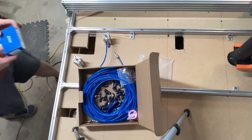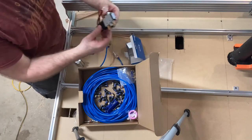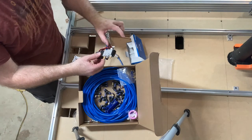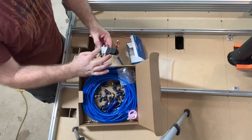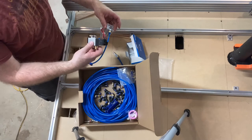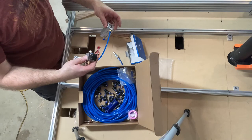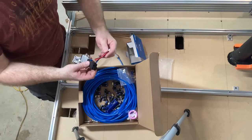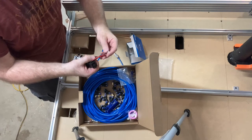Connected to the solenoid — this is a pneumatic valve solenoid where the airline comes in and splits off. When it's activated there's a little piston that opens and closes. When it's open the line goes in and the pin comes out; when it shuts it reverses and the air pushes the pin down. This is what will be connected to the black box to the open port.